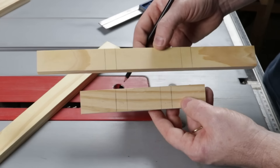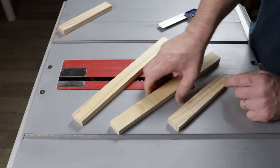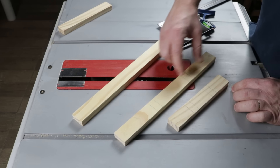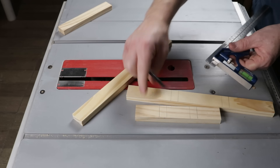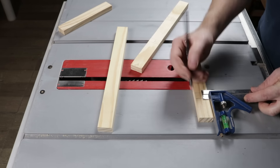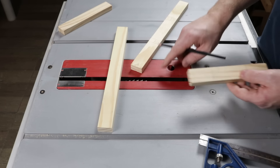The markings look like this. To get these measurements, you need to take the length of the piece minus two times the thickness, divided by three — then you will have the required interval. Now I have set the square to 15 millimeters and will make a mark like this. This is the part I will remove on the table saw from all pieces.